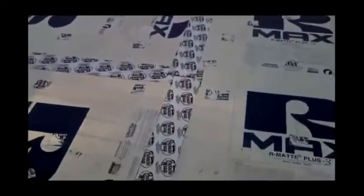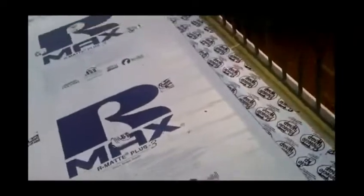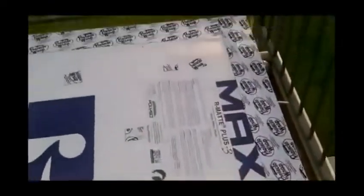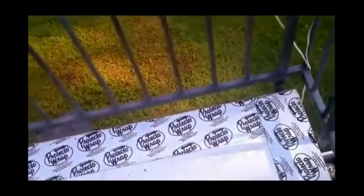One last look at the final deck preparation. You'll see that we've used rigid foam insulation and butyl tape to cover up seams and any gaps, with drip edges installed under the butyl tape — so we've got a good connection there. We've used a rubber membrane to go up 18 inches under the shingles to create the required flashing. All in all, we have materials that will adhere nicely to the liquid rubber membrane we're about to apply.